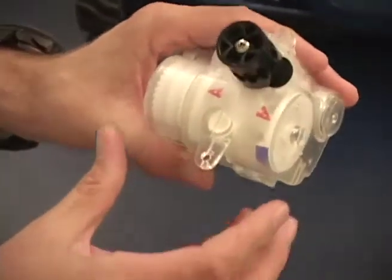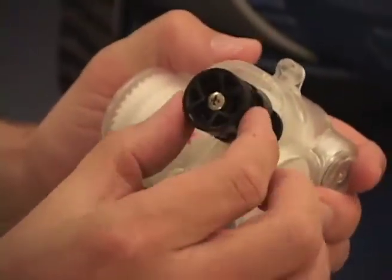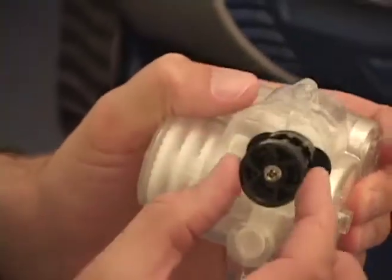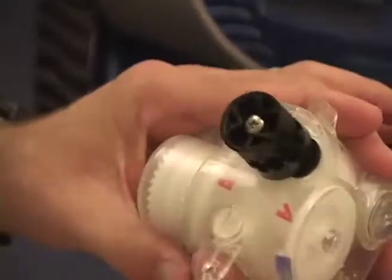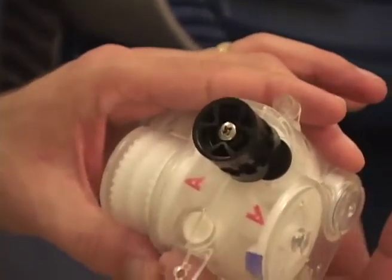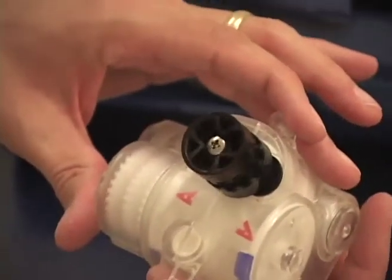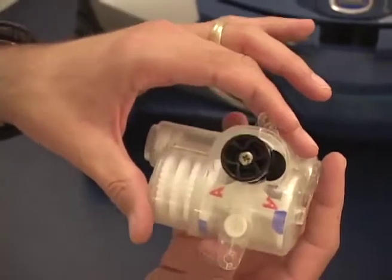Now we'll go over a couple issues to watch out for. The first issue is the tightness of the drive pulley. The drive pulley, when in gear, should be relatively tight within the system. As you remember, when we move the cams into position, this is going in the forward direction. As the cams get ready to move into reverse, there is a neutral position shown there.